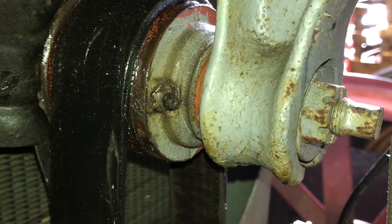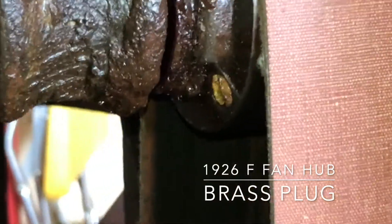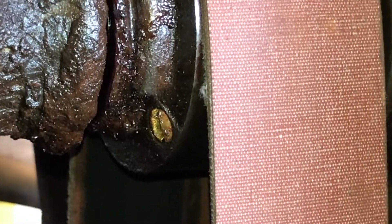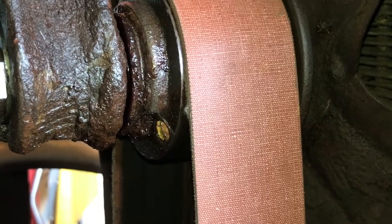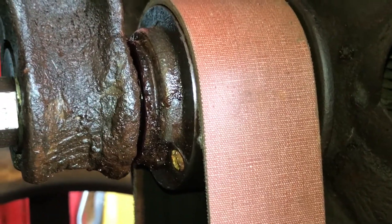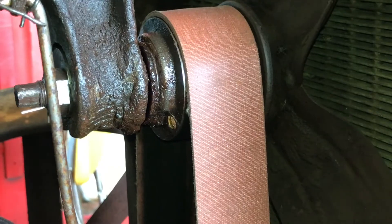If you notice, we'll switch over to the 1926 Fordson. This is the style of plug that should be in the fan hub — just a brass threaded plug. One manual said to top this hub off with a heavy gear oil, and I did that with some 600W from the rear end of the tractor. However, it tends to seep out over time, so I ended up packing this hub with grease. That's what we're going to do on the 1924 and see how it works.